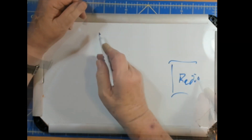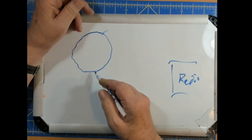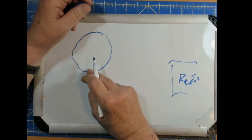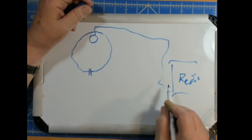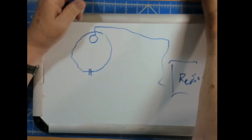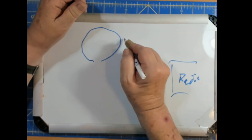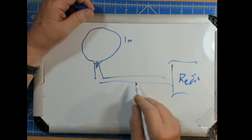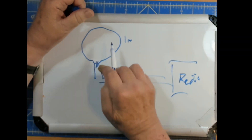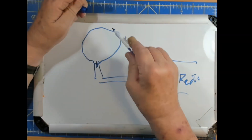So you've got a radio of some kind over here, and you want to feed it. These are available from a number of different sources — you can get them at DX Engineering or make your own. What they are is a loop that's got a capacitor in it. And then there's a driver loop up here, and this is what goes down to the radio. If you want to use one of these just to receive, you can do it a lot differently. You can just put the loop — these are like one meter across — and put a little capacitor right here. These are your leads, they go to the radio; it's a balanced antenna. This little capacitor will find the resonance spot and, through the miracle of resonance, will cause some amplification in the signal.